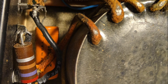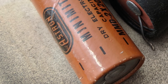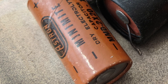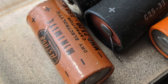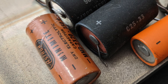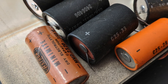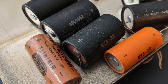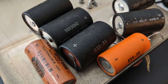I decided to restore one, and we'll take a brief look at what I did. One of the biggest problems restoring older equipment, particularly power supplies, is that the parts have aged and oftentimes go bad. Electrolytic capacitors in particular will go bad over time and can become dangerous to leave in circuit because they can short-circuit the equipment. Additionally, carbon resistors can change value over time — they can increase in value particularly. So I had to check the values of all of the carbon resistors, and any that were more than 20% off, I replaced, as well as replacing all the electrolytics.